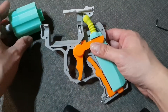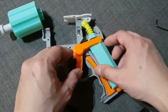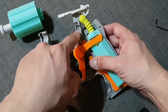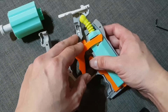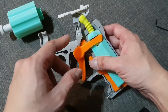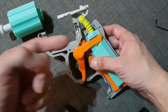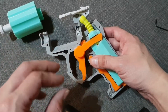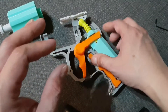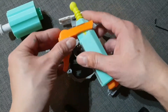This is the hand. If you do have a sticky trigger, chances are either the hand — the size of the hand — is too big, too wide, so it doesn't move freely. Or the spring outer diameter of the strong spring here is too wide. The perfect size is under 4.5 millimeter outer diameter, as I just measured for you.